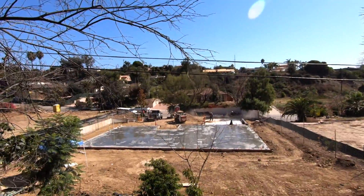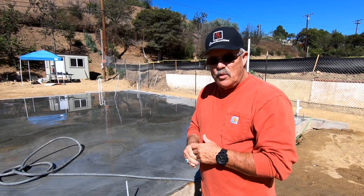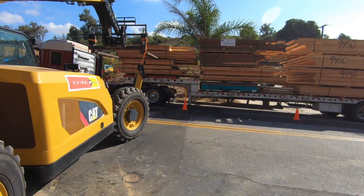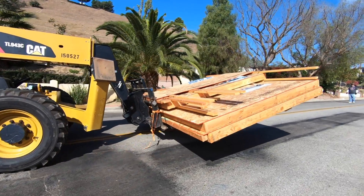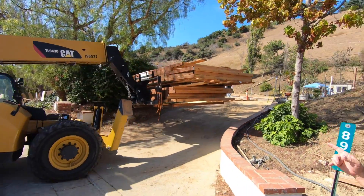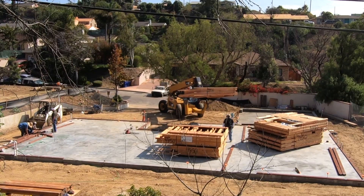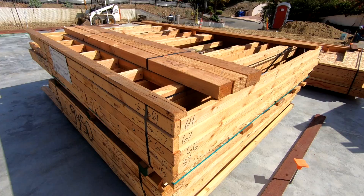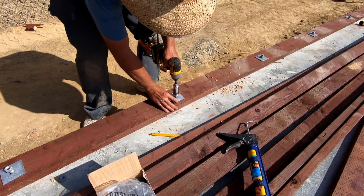What you see here is the foundation of our new home. What's going to happen is the house framing will go up in about a week, and that's complete with the structural siding on the outside and the windows in. This is a pallet of panels that we're going to be erecting on the outside and on the inside. All these are walls that will stand up on the outside and on the inside, and one by one, as we lift them, we stack them and bolt them and fasten them together.